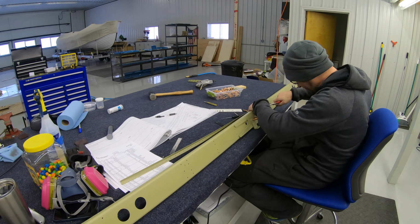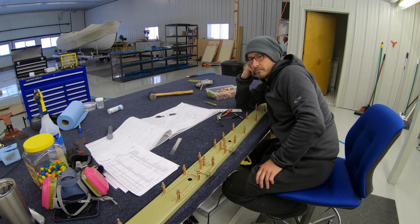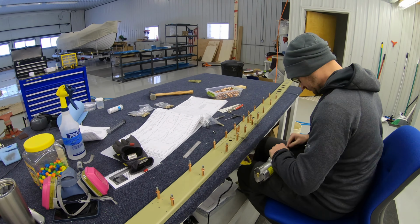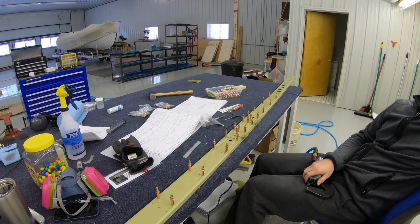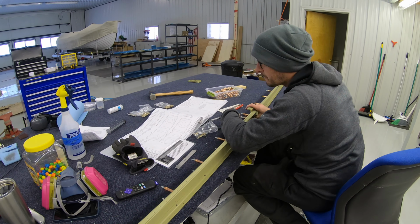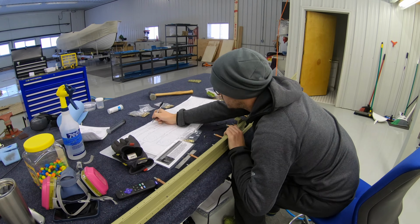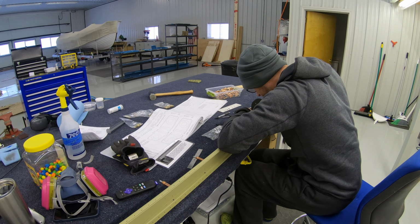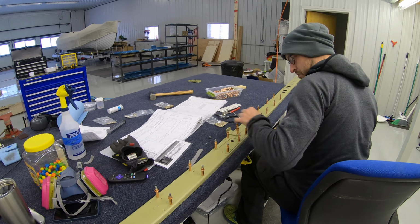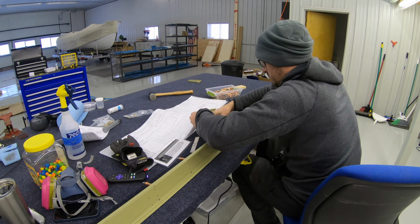Now it's time to get the forward spar doublers and caps in place, as well as those forward attach brackets. There are a lot of one-off rivets in this section because you're going through either just the spar and a cap, or a spar and a doubler, or the spar, the doubler and a cap, or the spar and the bracket